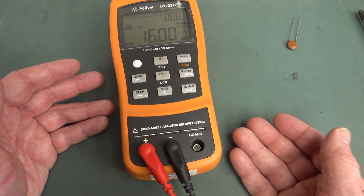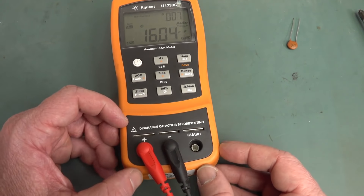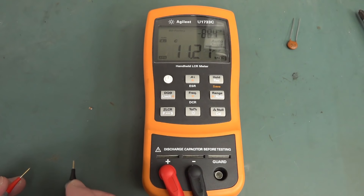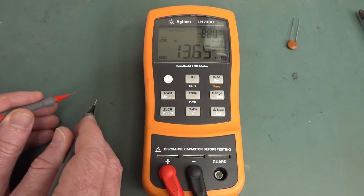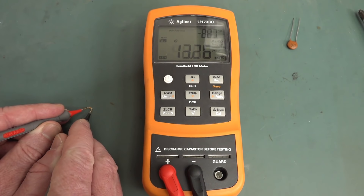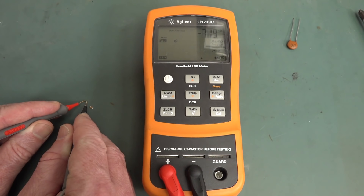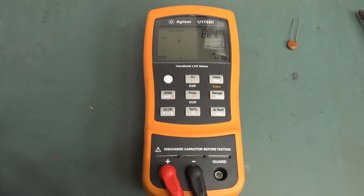If you want to measure surface mount stuff, you can get an adapter that plugs in, and you can get your tweezers and put your little surface mount part on there and try to hold it down. Or you can plug in some probes and measure your surface mount parts. Even with really fine probes, it can be a little bit tricky — you've got to use both hands and get in there. If you're having a bad day, the part will just flip and vanish. With ultra-miniature Fluke probes, you can get in there, but if I accidentally put the wrong pressure or my hand slips, that part can just flip off and land on the carpet — and you'll never see the damn thing again.